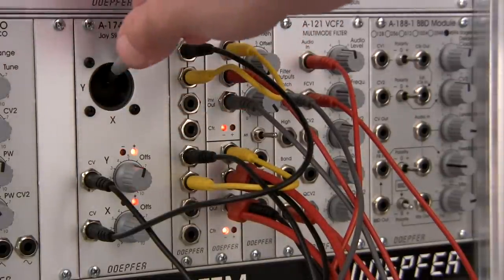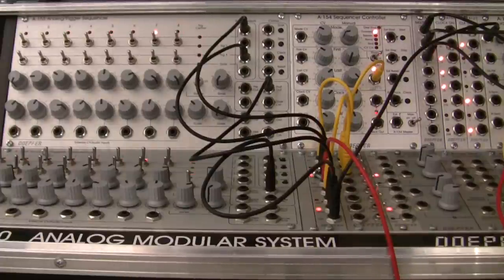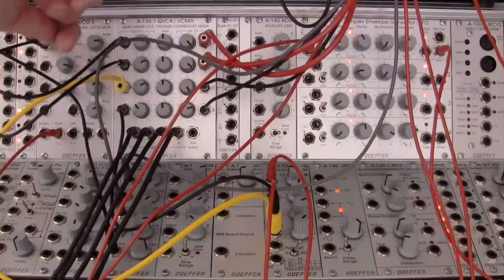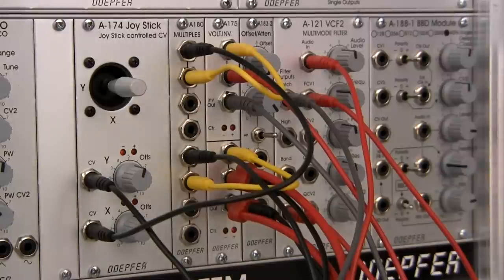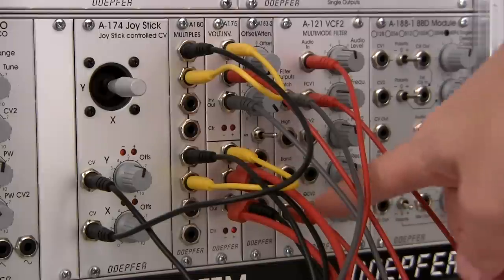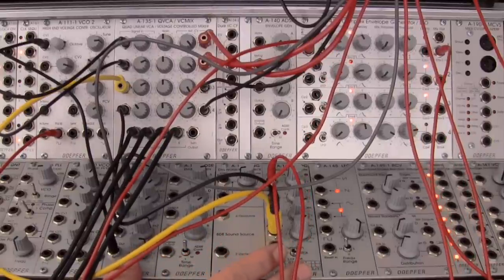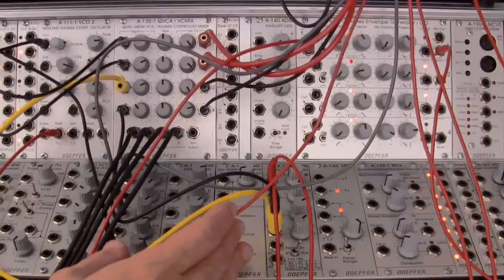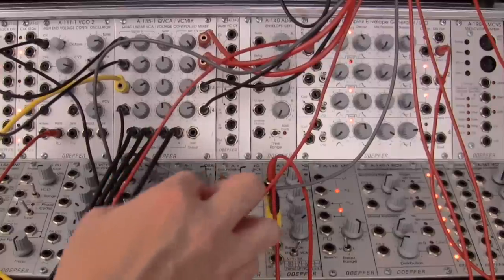For my sound source I chose to patch my A155, taking just a few notes from there over to my A111. On the A111 I have that going out to the A121 multi-mode filter. Then I have the two outputs — the notch and the low pass — going down into VCA1 and VCA2, which are the ones at the audio input section of the patch. From there they go out to their respective locations in the VCAs. One of them is actually multed — that's VCA2 — and goes to inputs 3 and 4.